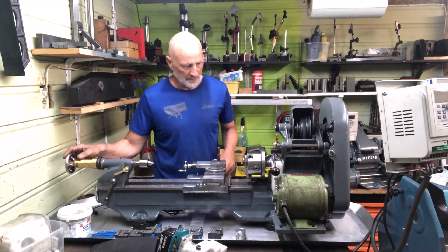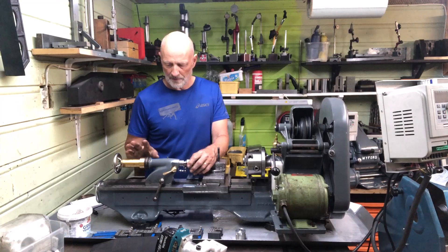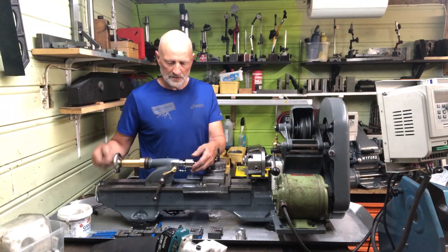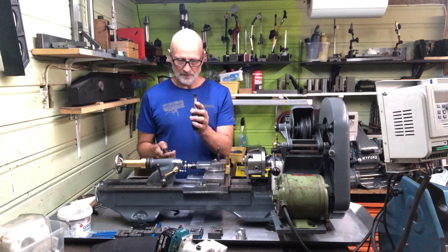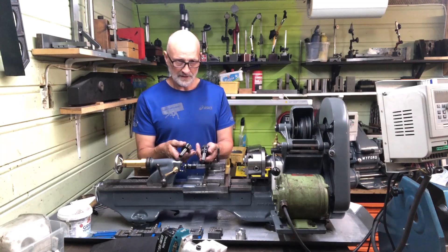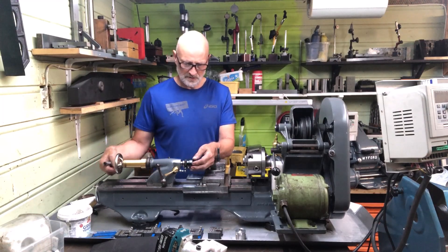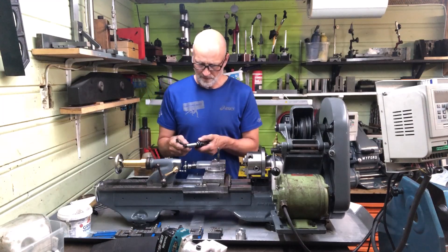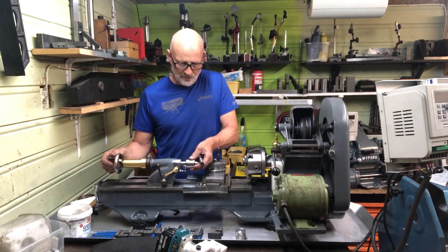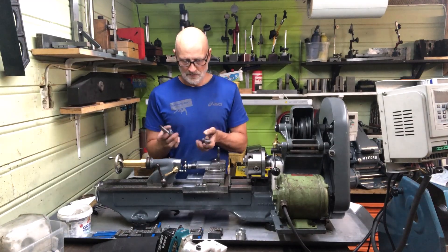This also incorporates a couple of other changes. One being that I have covered the barrel of the tailstock here and also added an ejector. The ejector functions on the tang. Be aware that there are different versions and different lengths you can purchase — this one's a little bit longer. I made it so that it loses grip exactly where the barrel meets the tailstock body. On another one it needs more force and might need an extension.